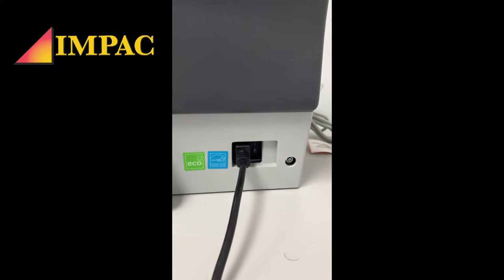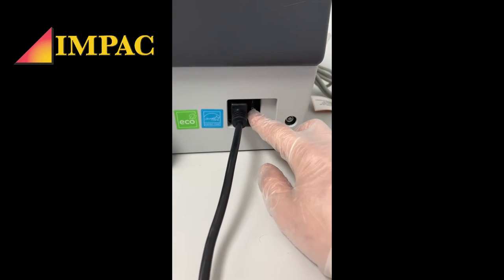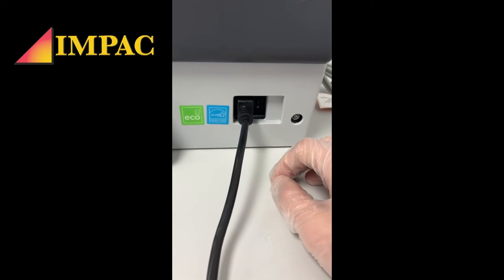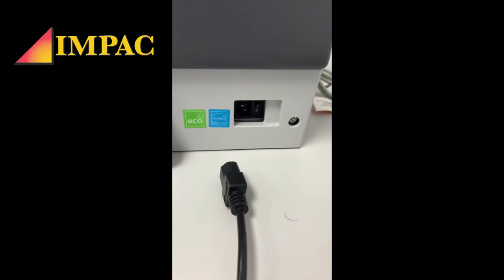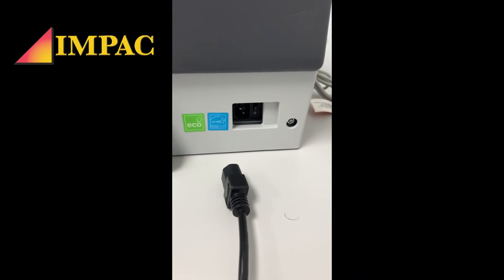The first thing you want to do is always shut down your machine fully. Most models have a little switch beside the power switch on the right hand side that you want to flip. After flipping that, you should unplug it completely. This is to make sure there is no power and no voltage going into the machine, for safety reasons, of course.